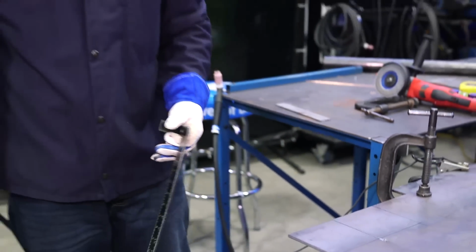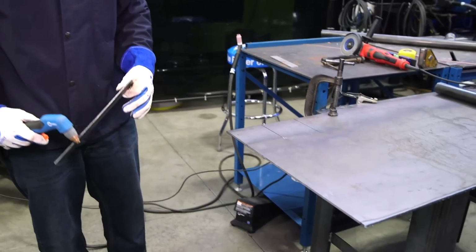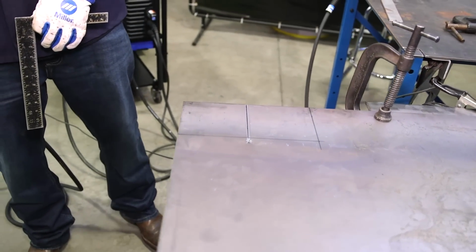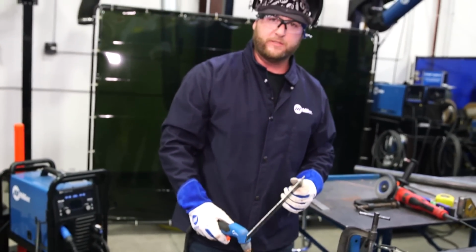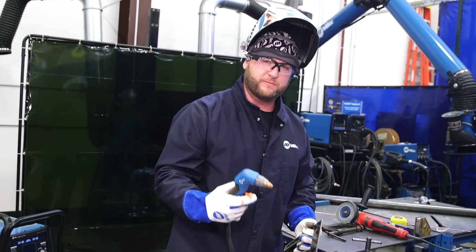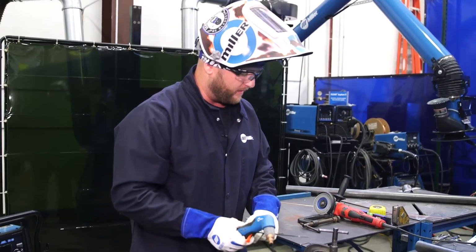And as you can see, that took about 2 to 3 seconds. It's a perfect cut. Small kerf, you're not losing a lot of material tolerances. And that's another big thing compared to the oxyacetylene side, where most people would be doing that. You have a nice 1/4 inch wide kerf. When you use plasma, it's very, very defined, a very fine line. It's a great thing to have.